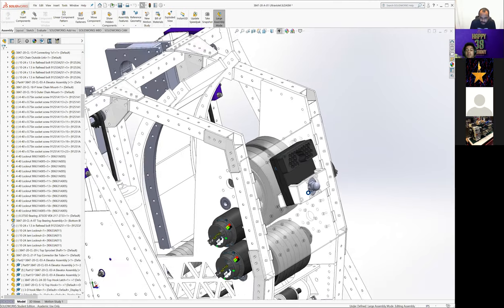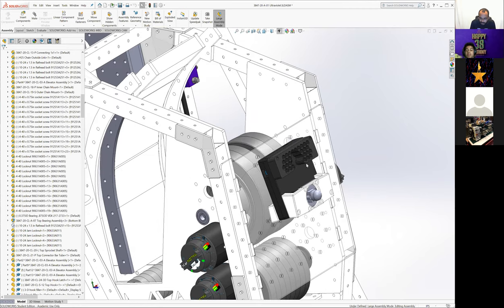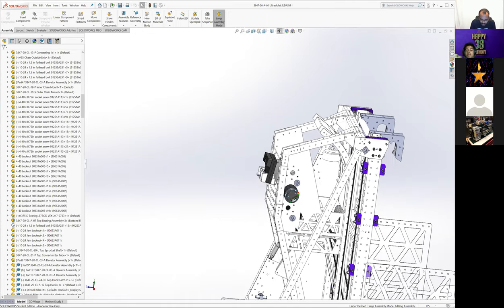From the front side, we don't actually have a view of the front other than whatever is retroreflecting off the Limelight at the time. So we get the retroreflective tape and any field lights and stuff through that image, but that's about it. Because we're not changing the settings or contrast or anything to give us a normal image. It's always the darkened Limelight image that's just looking for the vision targets.